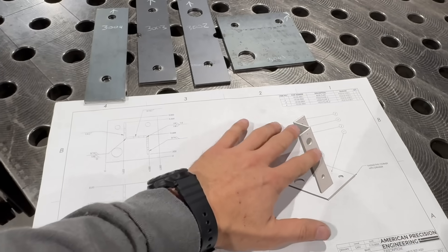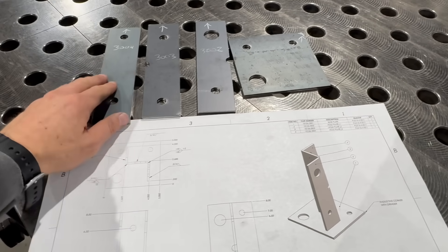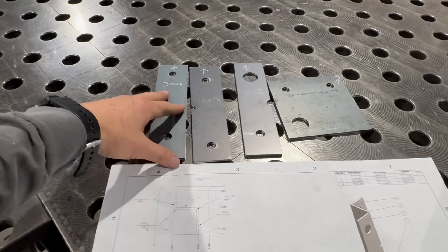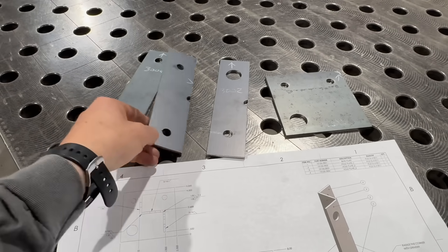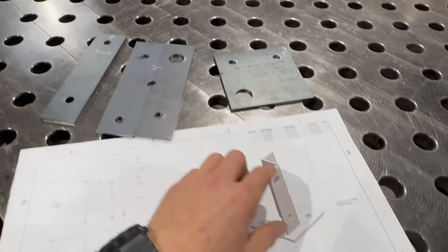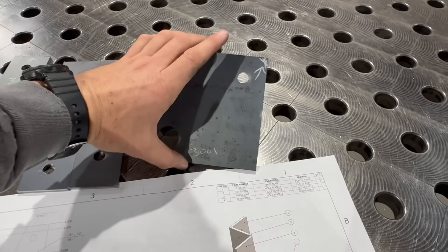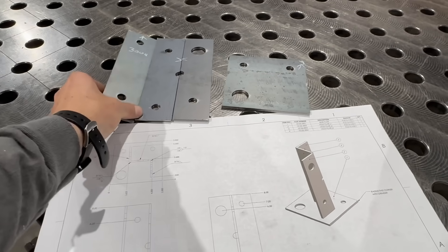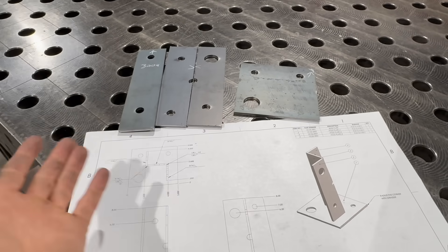Right off the bat I'm studying the drawing and writing part numbers on the parts from the bill of materials - to make sure I've got the right part. Some of these are very similar; whoever designed this must have been trying to trick people. There's an orientation with a big gap and a small gap, so I'm putting an arrow for 'up' on each one, and little alignment tabs where parts line up. I caught a note to grind a radius, so I'm marking that on my part so I don't forget.